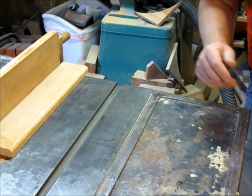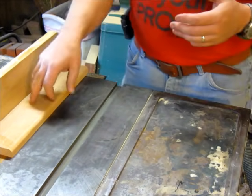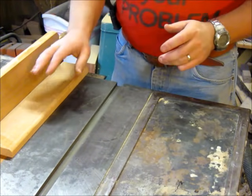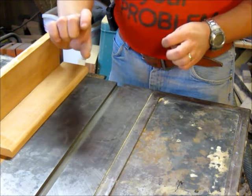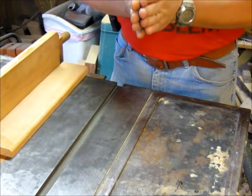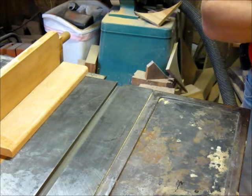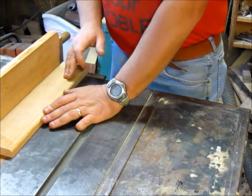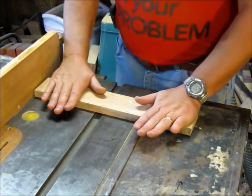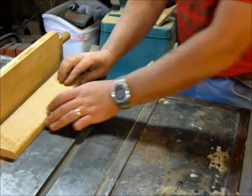Now the clamp, my lathe bed is 4.5 inches wide. So I want each one of these at least 4.5 inches long. It's going to be 1.5 inches wide and 1.5 inches thick, and it'll clamp to my ring, and it'll be glued and screwed to the ring, and it'll be clamped down to the lathe bed. What I'm going to do is rip this piece of oak down 1.5 inches by 1.5 inches, and then turn it and cut 4.5, 4.5, glue them together, screw them together, and mount them on the ring. And that's what I'm about to get ready to do now.